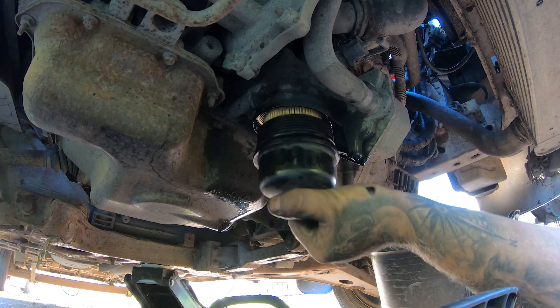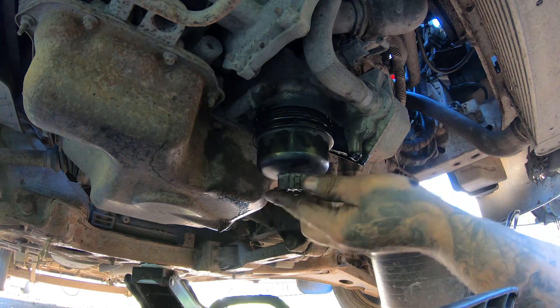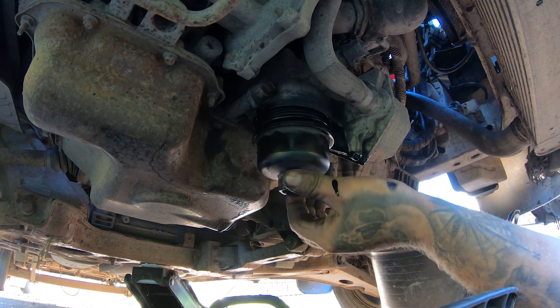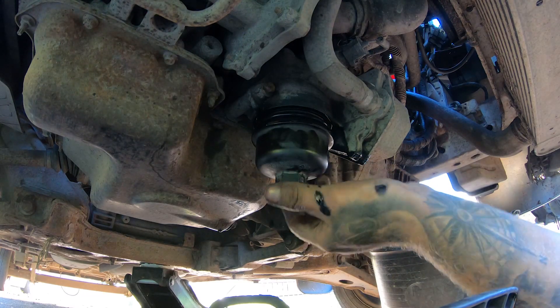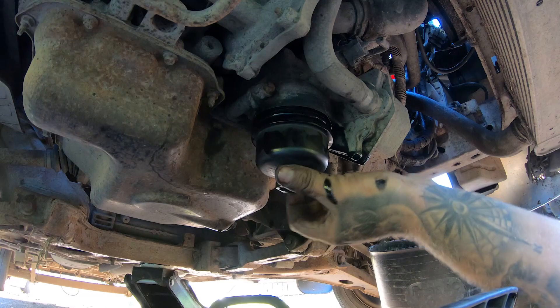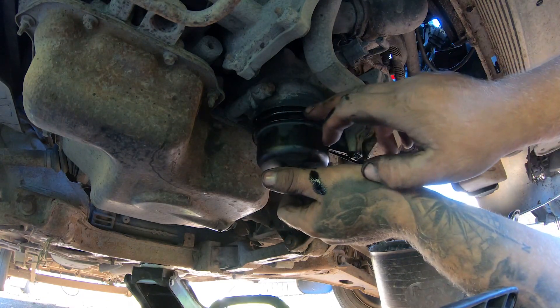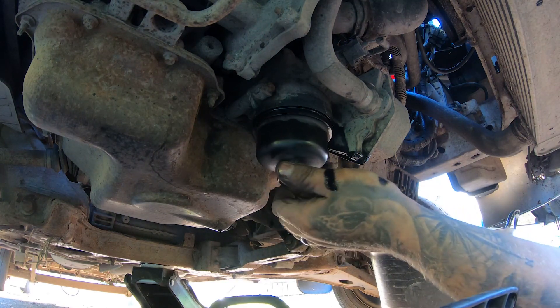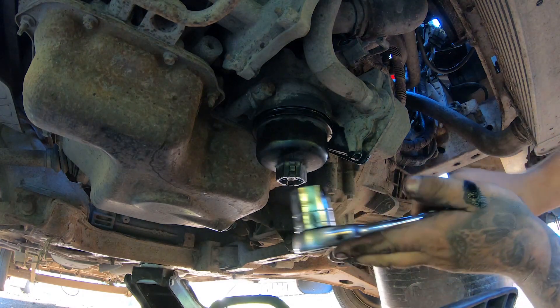If you're struggling to locate it going in, screw it backwards putting a bit of pressure up on it — go backwards for a little while. There, it just located. This is why you need to put oil on the o-ring, because when it gets to this point it can start to pinch and twist and then it'll break, which is what you don't need.